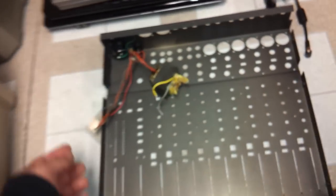Then I decided to check the primary winding of the power transformer and it was open. So I decided to disassemble the transformer to see if there's a thermal fuse, and there is none. So that transformer is wide open — no good.